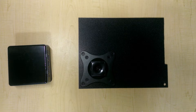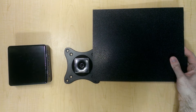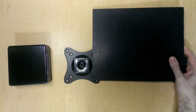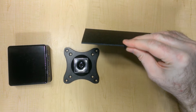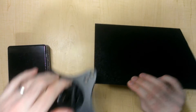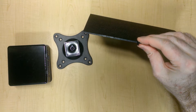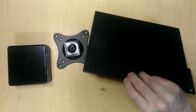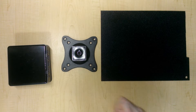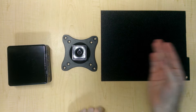I also need to consider whether I want to mount my extension bracket underneath the monitor's bracket or on top of it. If I mount underneath, the screws will go all the way through the thickness of the plastic and press into the back of the monitor, since I don't have any recesses to hide them. If I mount on top, the extra thickness of the monitor bracket will provide the necessary clearance to get the screws all the way through without touching the back of the monitor.